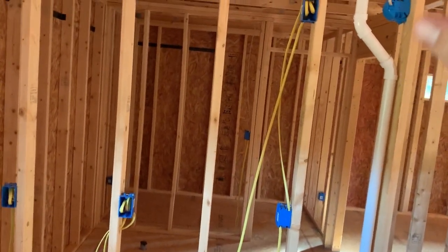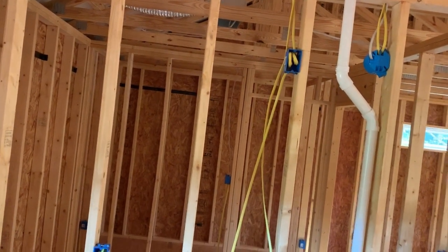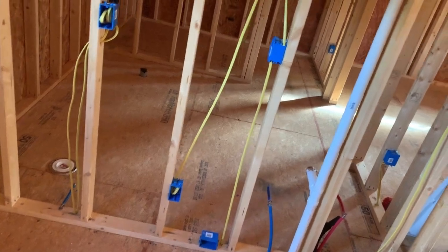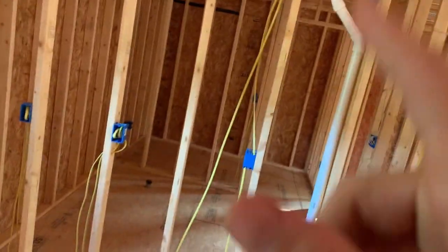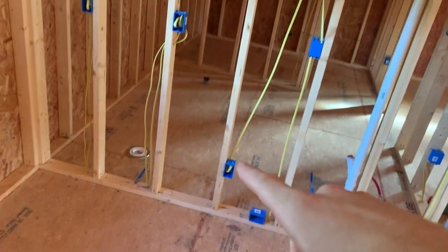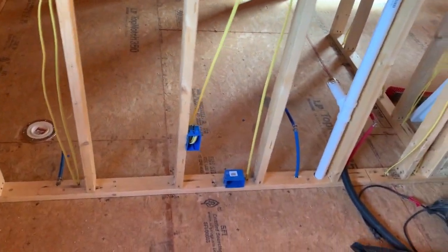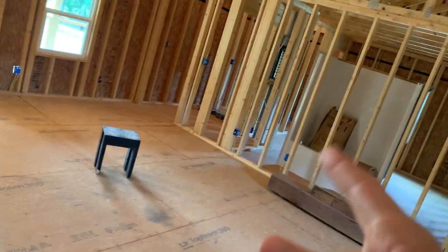I'm pretty sure Dad said each plug is rated for like 15 amps. The microwave usually runs like 10. A stove will run 1, maybe 2. So even then, that's only 12. So you're still good. So no more power than what just the timer and the clock, whatever, run on even on the gas stove. So we just jumped off of that down to here for power for that real quick. So we didn't forget that. The only wiring we have left to run is this bigger wire to run to the electric stove, to the power box.